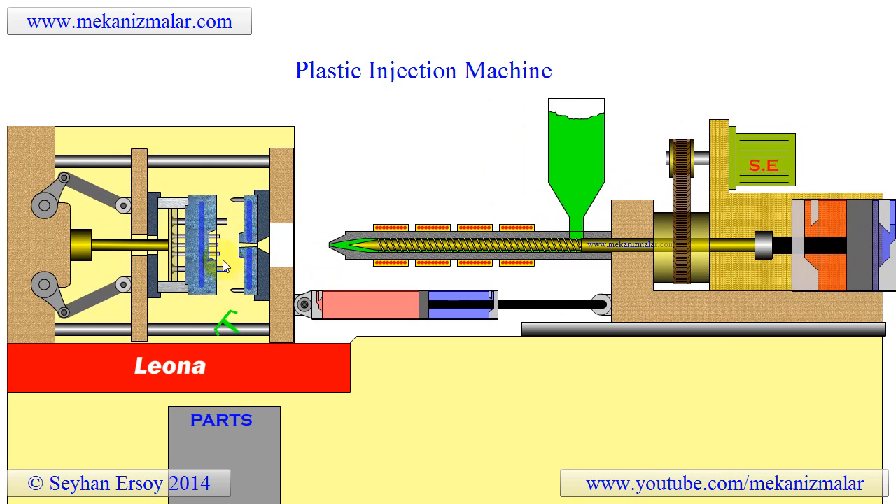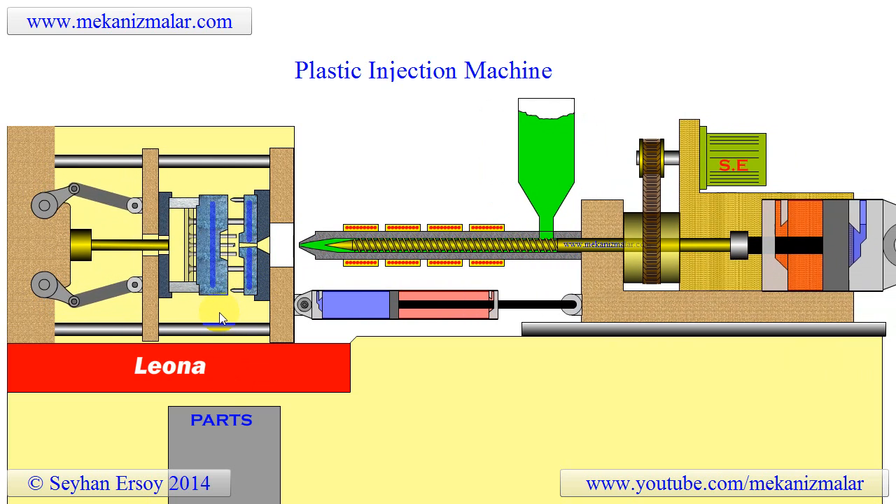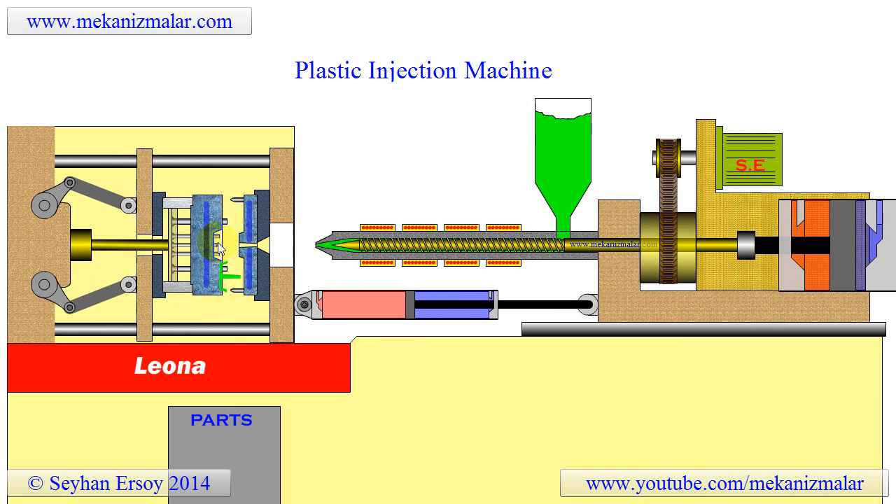In the video, the middle pin here has a groove at the tip. This groove is to help pull the part away from the fixed plate. While the mold is opening, the shorter push pins push the part and the part is ejected into a part collector.